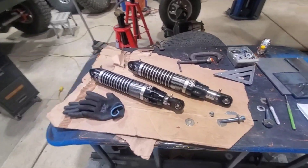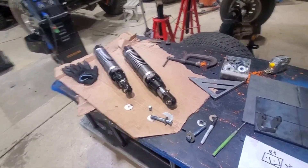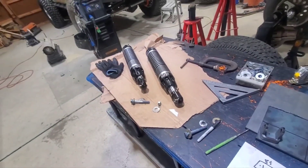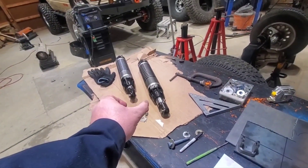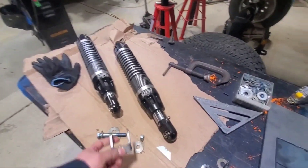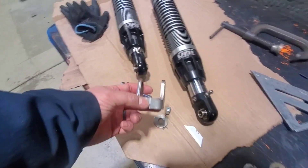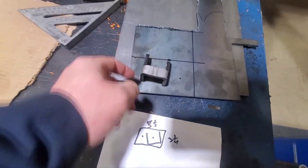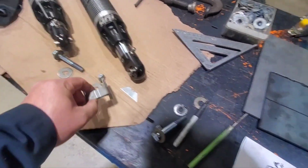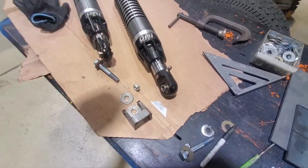Here are the front 12-inch ORIs. I still use a standard half-inch bolt to go through. The only difference is the width is 1.6 inches versus the common 1.5. So right off the bat, the mounts from Barnes 4WD are too narrow — not a big deal. I'm just going to slit them down the middle into two pieces and bolt them up snug using an ultra-thin washer to give me a little bit of play once they're welded.